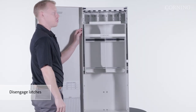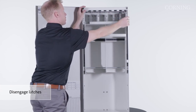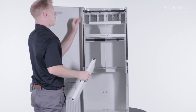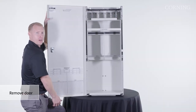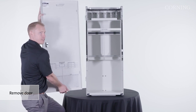To remove the top plate of the enclosure, simply push out on either side of the swell latches on the top of the plate and remove. This gives us full access to the cable entry foam and the retention brackets. To remove the door, hold on to the top and bottom, lift up off of the hinge pins and set it aside.